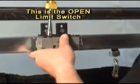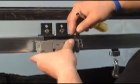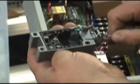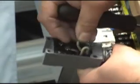Remove the open limit switch from its mounting bracket. Remove the two bolts on the front of the switch and separate the upper body of the switch from the lower body. For the open limit, locate terminals number 3 and 4 and the ground lug of the switch. These will be used for the open limit switch. Insert the cable that will be used for the limit switch and secure the cable with an appropriate clamp device. Attach the two limit switch wires to terminals 3 and 4 for the open switch.